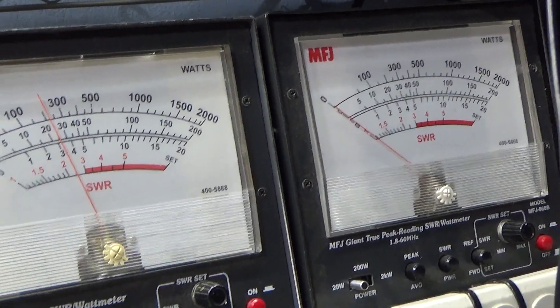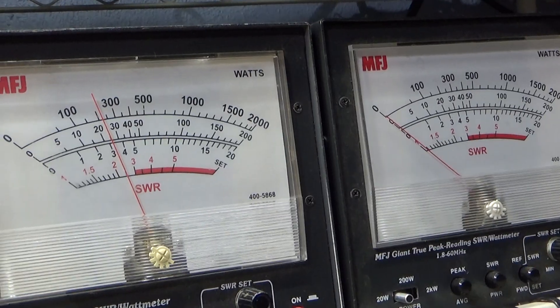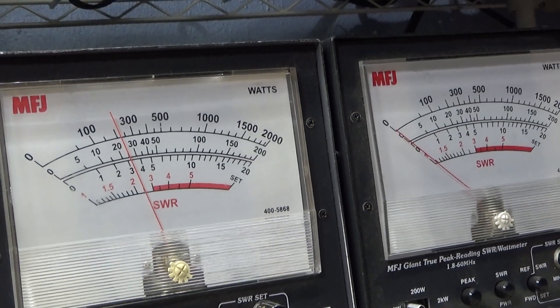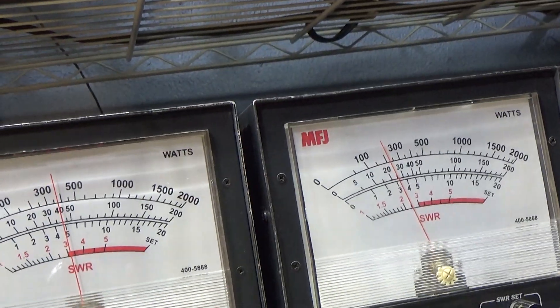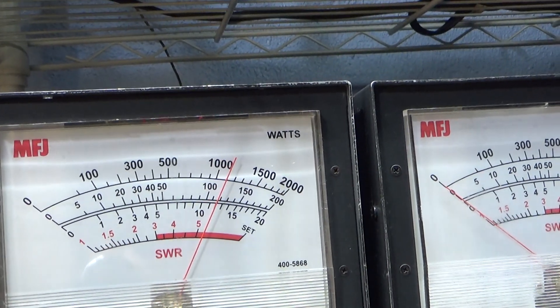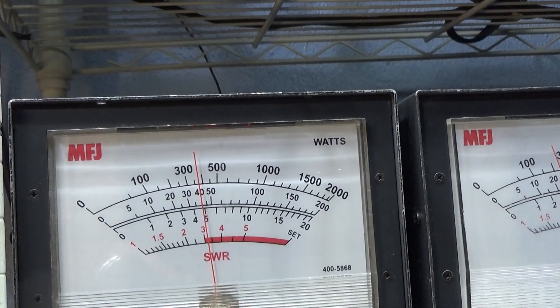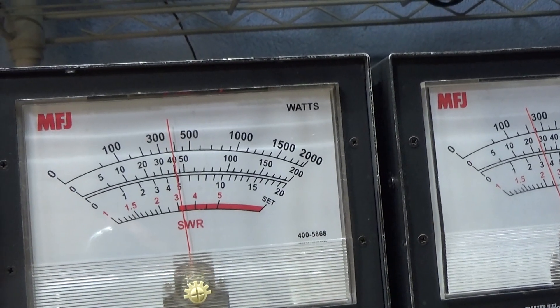This is the output side of that amp — see how many watts I'm losing. I got five going into the amp on that watt meter and then I got a little over three out, so I'm losing about 20 to 25 percent of my watts just going through this amp. Anyway, it's not about the amp, it's about watts. I push in the relay so it's opening that circuit, watts going out to zero. They're going in still, but going into a super high SWR — open circuit — so my SWR jumped up high. But am I really doing more watts? Not really.